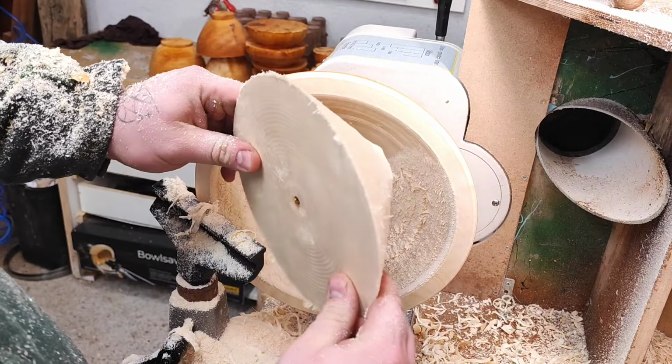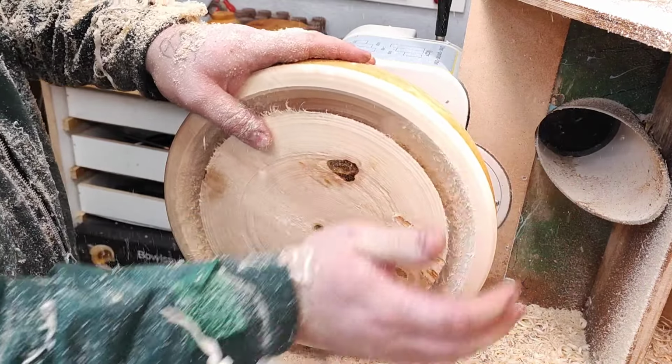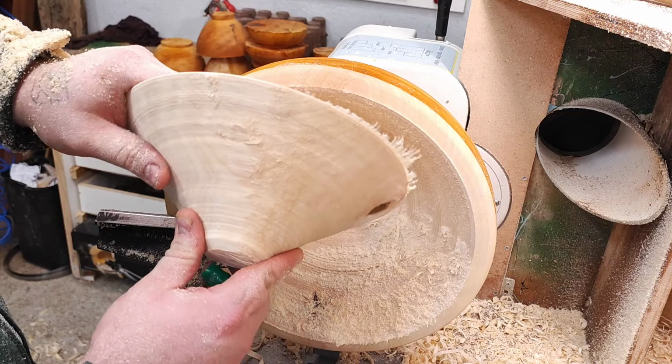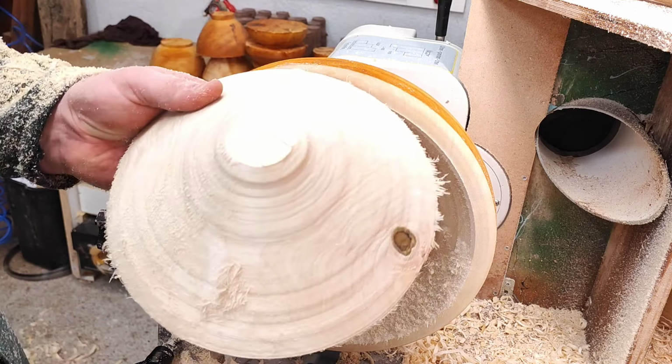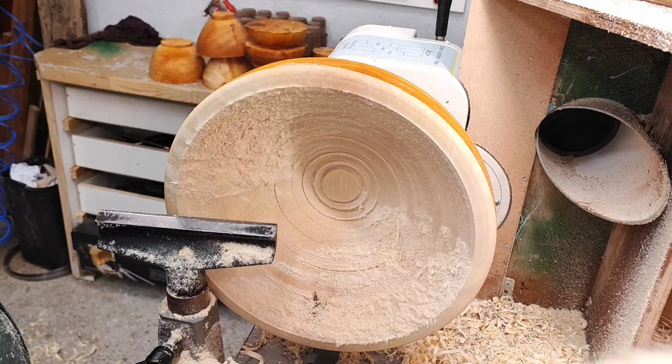And that's a nice little cone. This kind of Sorby slicer coring option isn't the most efficient one, because a Oneway or a McNaughton or a Woodcut will make spherical core outs, which are a much better use. However, I'm still happy to get a cone out, which I can then turn into triangular bowls or a flared out bowl, or boxes, lids for the boxes and stuff like that. So there is always a purpose for these.